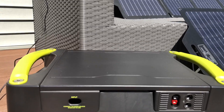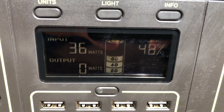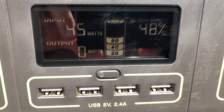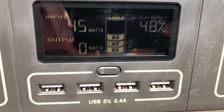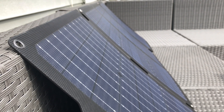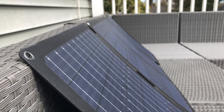Now switching to the 60-watt TP Solar folding panel. Plugging into the PWM port, it reads 36 to 37 watts — 62% of rated capacity, within just a percentage or two of its larger sibling. Plugging into the MPPT gives about 45 watts — 75% of rated capacity, only two percent less than the Boulder 100. Given the natural variance when plugging and unplugging, I'd say these measure pretty much the same. The Boulder might be a percentage or two more efficient, but it's essentially a wash — and these are significantly lighter, so I think it's a good trade-off.